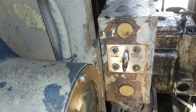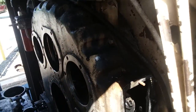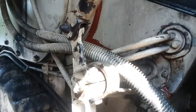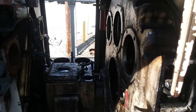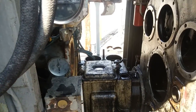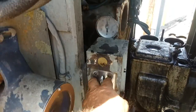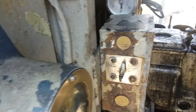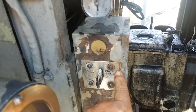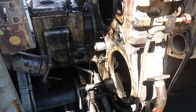This is actually how you start the locomotive. This is called a lay shaft lever and it hooks down into the governor, which is off right now. You would set that up — that sets your injector racks up on the engine. Set that up to about 1.5. Then obviously I'm not going to start it for you, but you'd be in your cab. Your isolation switch would have to be on start, and of course the battery turned on. Run this over to the left here to fuel prime it for about 20 seconds or so, then flip it over here to engine start. That's how you start this engine. There is no way to start it in the cab — you've got to come out here and do it.